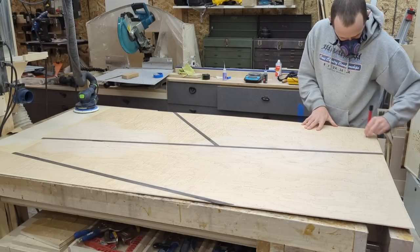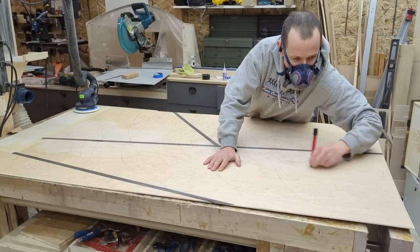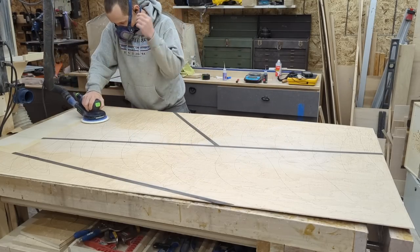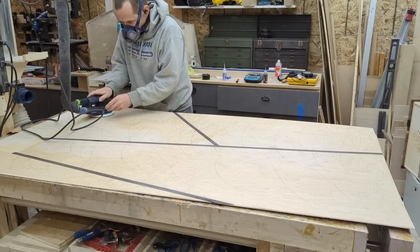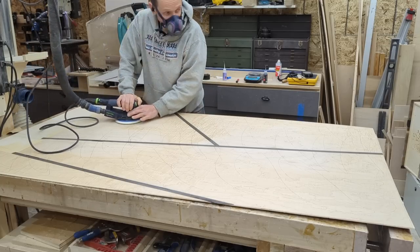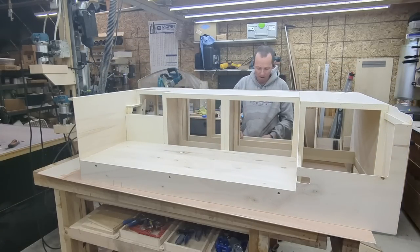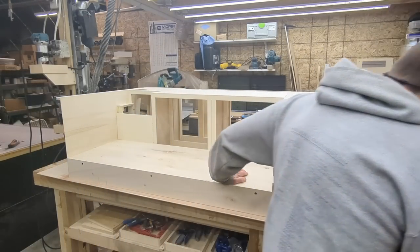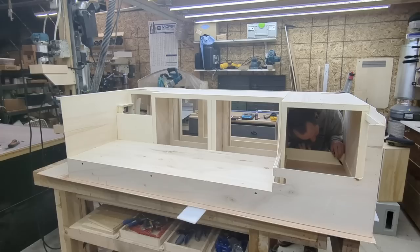Then it's just time to do some sanding. What you see me doing with the pencil is making marks all over the sheet so I can tell I haven't missed spots by not getting those pencil marks off. I also started at an extremely high grit — probably 150 if not 180. With these one-of-a-kind veneered sheets you want to minimize the chance you'll accidentally blow through that outer veneer and have some glue showing. By starting with a really high grit, I'm not afraid I'm going to dig in too deep and end up blowing through that outer face. Then it's time to draw out where I'll be making the cuts. For this project I essentially have to be within a 32nd of an inch of where I want my final cuts. It works easiest to flip the sheet over, put the cabinet on top of it, and make reference marks by tracing the cabinet where I need to cut.